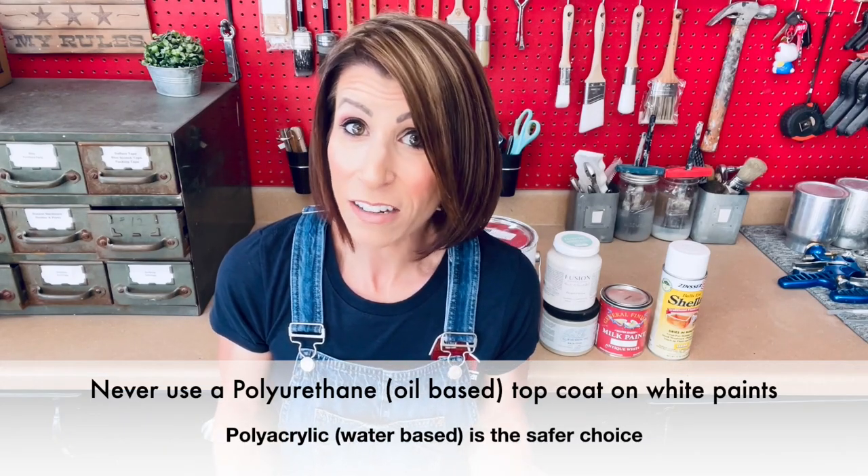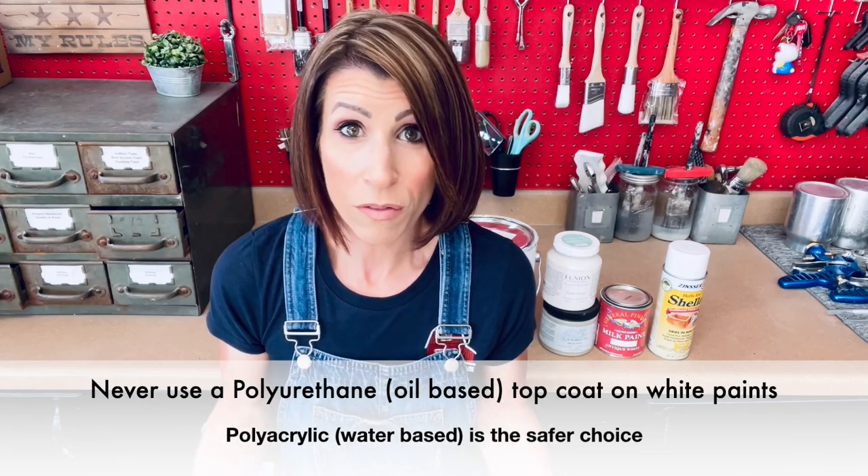Here's the problem. It's an industry-wide issue that white will yellow on its own over time. When you add something like a water-based poly to it, it can actually do it instantly or over time as well. There are many products out there that are all-in-ones that will provide you the durability you need without having to topcoat that white. It's become such a popular issue that some paint companies actually put a warning label on their bright white lids that say do not topcoat this bright white as it may yellow.